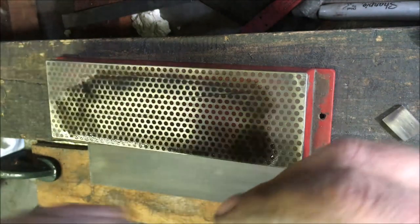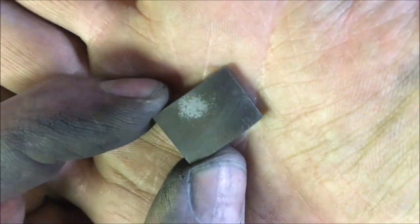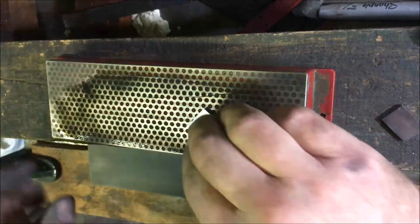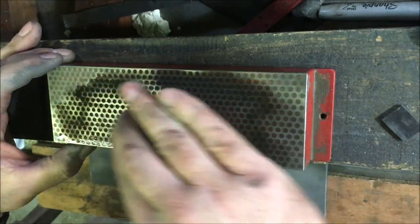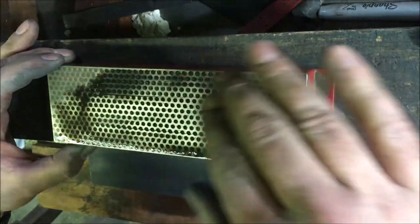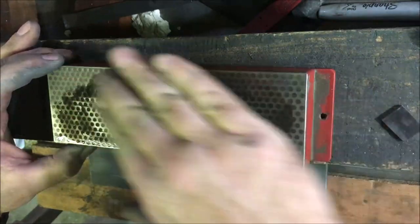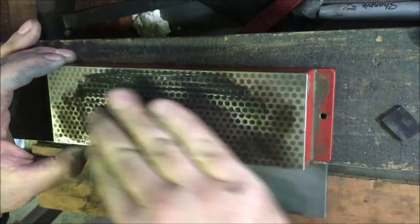Now this is coming in pretty quick, and I'm guessing it's partly because of the relatively small size. So you can see that the scratches have reduced in size. I just want to clean them up along this bottom edge, and then the same on that side. And then we're going to try and have a go at brazing it. Now my problem is I've only got a propane torch, got quite a big head for it, so I don't know what I've got in the way of brazing. Well, I've certainly got no brazing flux that I'm aware of. I've got soldering flux. So I might have to do that on another day. But I'm going to get it all prepped up today. Bring you back when we're bright and shiny.